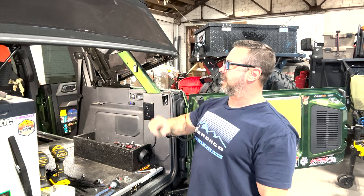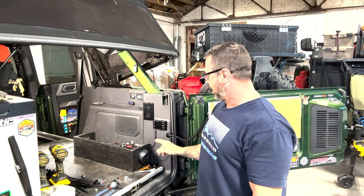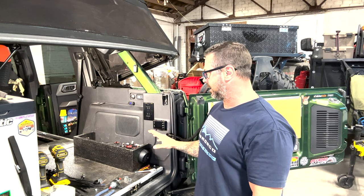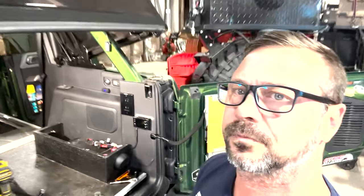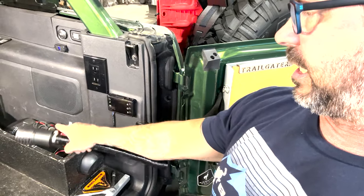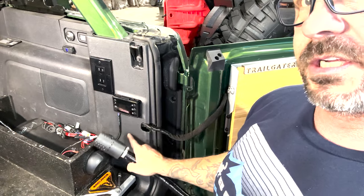So that's the concept behind it, right? So if it's blowing up there, constantly moving around, when it finally gets over here, it's coming to this intake side, going back in, and it reaches the temperature you set here, at that point, it'll go ahead and turn off and go into fan mode. So that's what I did. This is this, and let me show you the electrical. So there it is. I went ahead and dressed everything, tied everything to the side and attached it. And then basically this comes up to here, and then that's all your extension coming out.